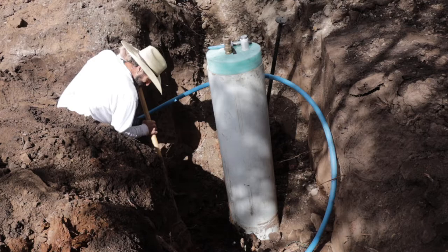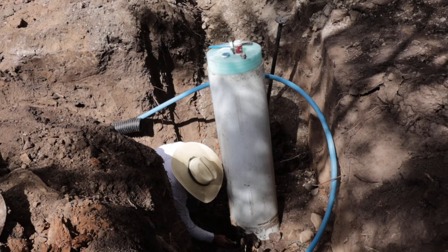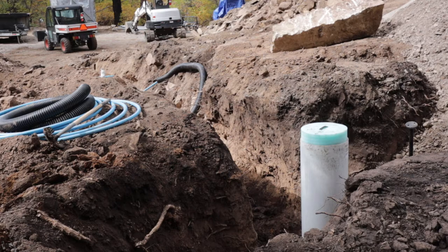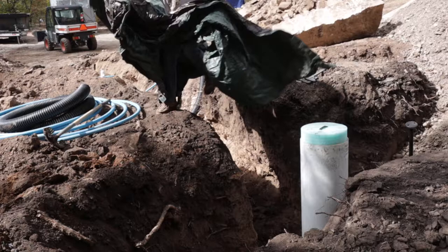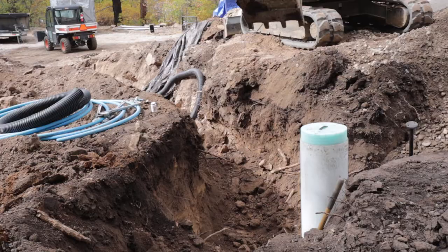What I usually do — because I've been doing plumbing for many years — is put Teflon tape on and then put pipe dope on the outside of the Teflon tape, and it never leaks. I figured out I needed to take this corner out, so I moved the pipe out of the way, put some plastic down in the trench to protect the bottom outlet of the meter, and got the backhoe to dig out the corner and give myself more room. I then hand-dug around the valve to make sure I could see it.